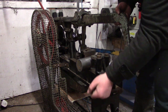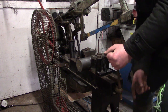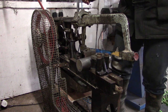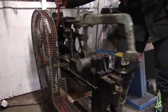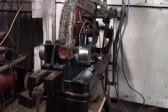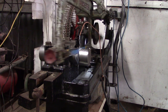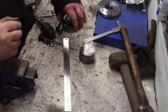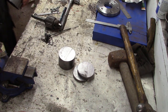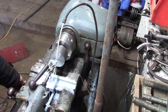Meeting a lump of 75mm mild steel. I'll finish off painting this machine one day - I do like that machine, very handy. And all the blanks that I cut out of that bar are there - these are the other end of the axle tube, the housings for the bearings if you like. Going to slowly bore it out.